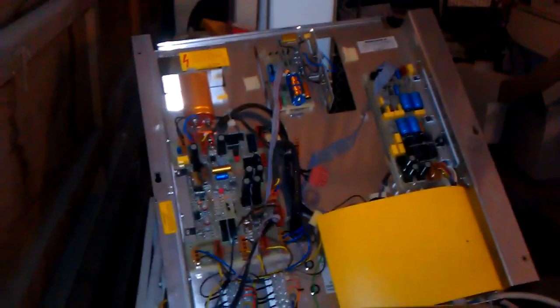I was hoping for two larger ones and then two smaller ones, if possible, and other bits. But you have to bear in mind these are all used for X-ray departments. Even a small X-ray generator is 50 kilowatt, so they have to take 640 mA at 100 kV. So they have to be a physical size to do that.